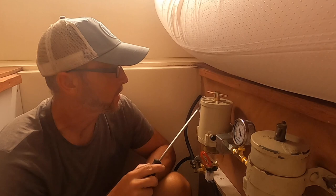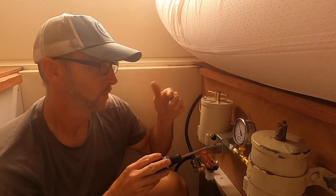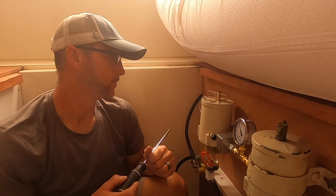One thing I'm noticing on the knockoff Racor is that access to the mounting brackets in the back is pretty terrible. Unless you mount it first before you do all the plumbing and make provisions for it to just slide over and then tighten the fasteners, it is a real bear. You really can't get back in there at all once it's plumbed in. But sooner or later I'll find the right tool. Sometimes you get what you pay for.